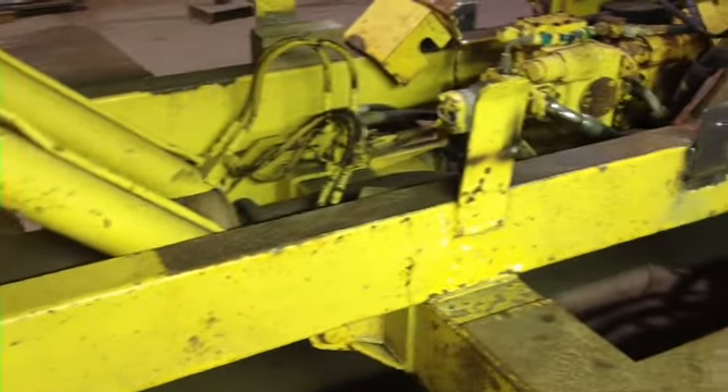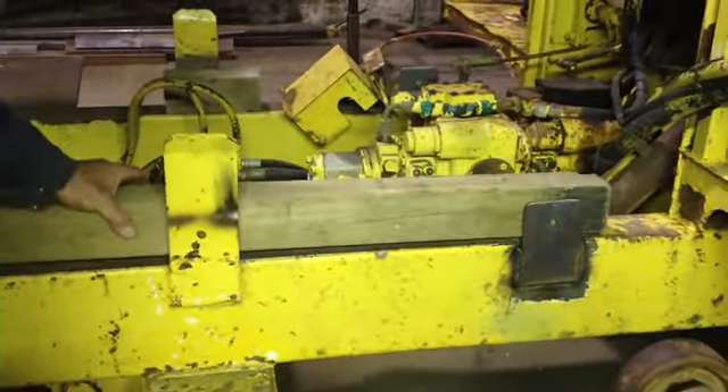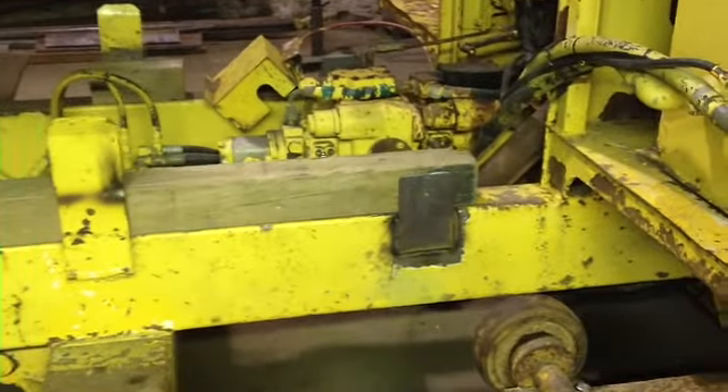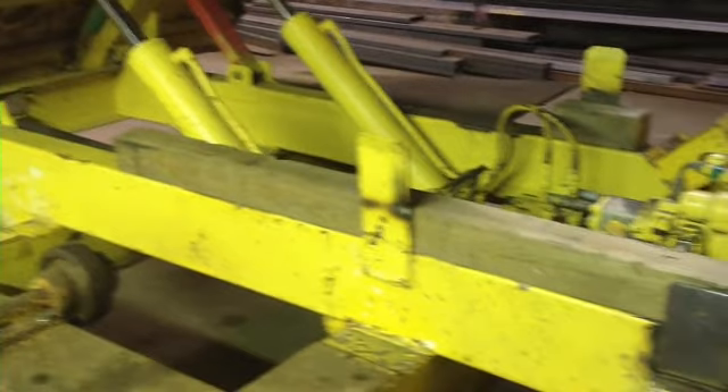This is the frame rail of the dumper, and there are two brackets with holes in them. Those brackets will have a through bolt go through there, and we set a piece of wood right in there so that when the box comes down, it lands on top of that piece of wood. This usually has to be replaced with a new piece of wood, and the wood should be thick enough that the box lands on it flat when the box frame rail lands on it. You can see where it has hit in the past and lands on there.